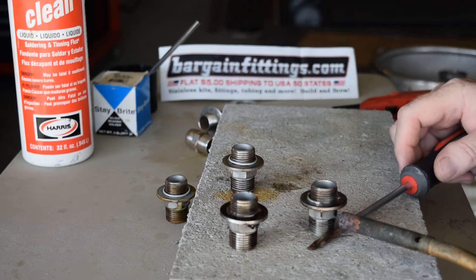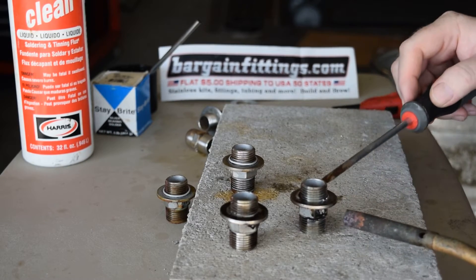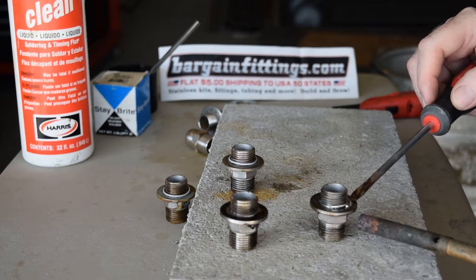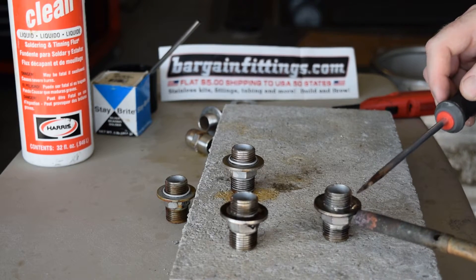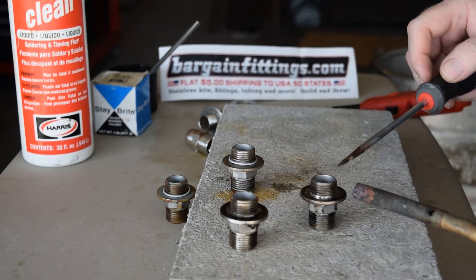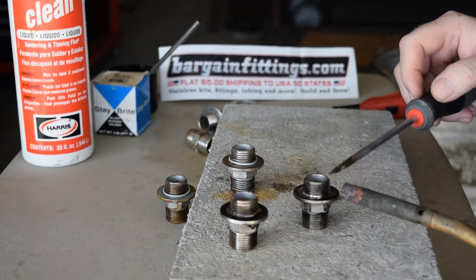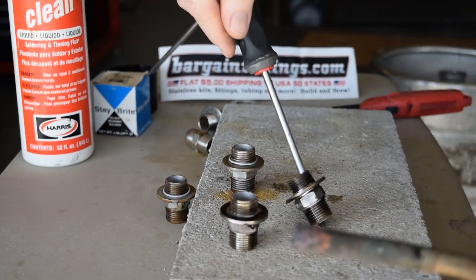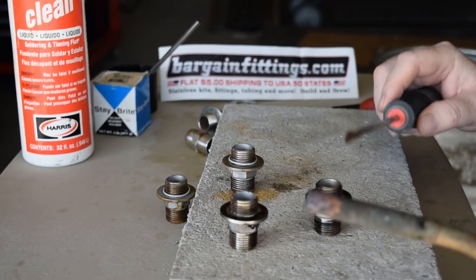In that case, I just work around and eventually you can see it's wicking into the joint. I'm rotating it and watching it, and I'll come back around and keep the heat at the top of the thread to get it to wick back up if I see that it hasn't made it around. I'll also look underneath — and I notice this washer is off-center a little.